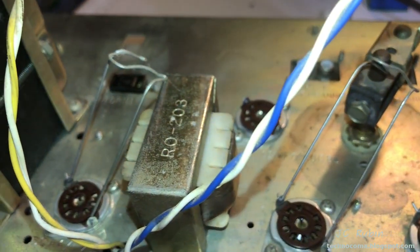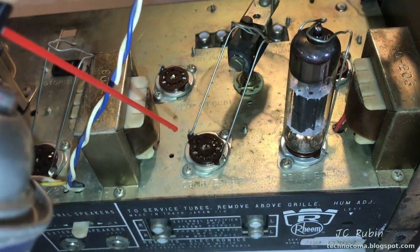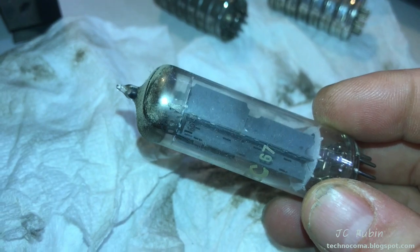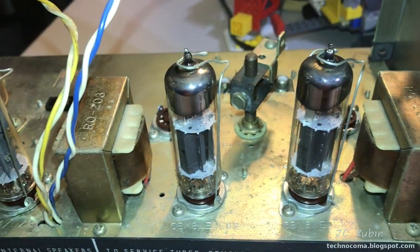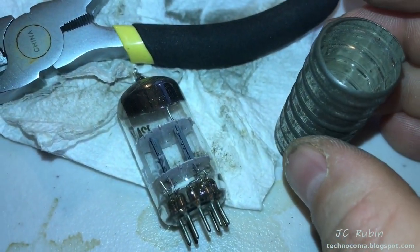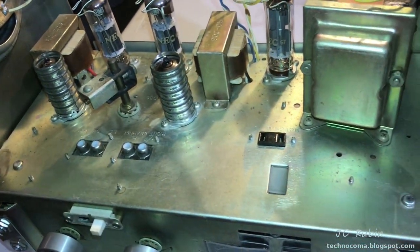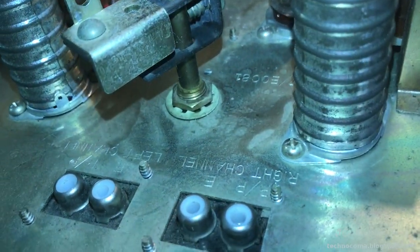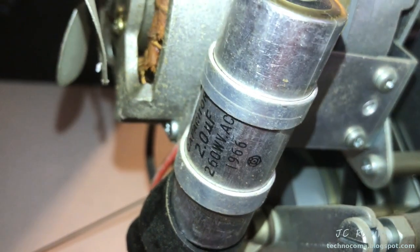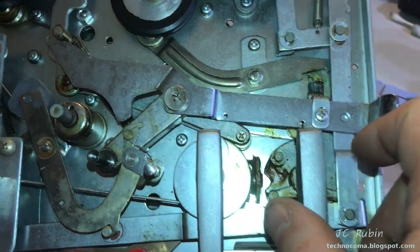As predicted, the tubes clean up very nicely — they're tiny little things, 6BM8, with what might be a '67 date code. All tubes have been removed and the chassis is now dust-free — not showroom shine, but all the dust is gone. Next contestant looks like a rectifier with a metal case; there's a little flange to bend up on the bottom then push it out. I'm cleaning up the sockets, same procedure. The top end also has a 2µF capacitor that needs replacement — it looks like it has a date code of '66.